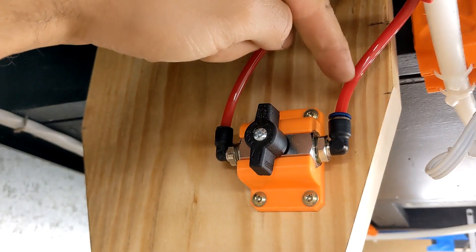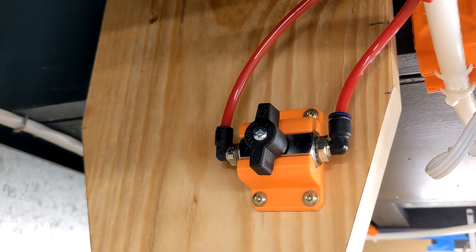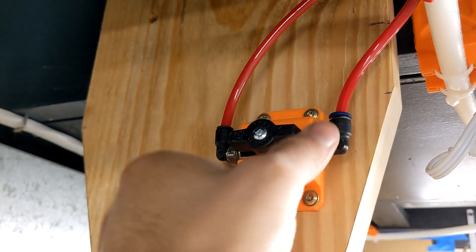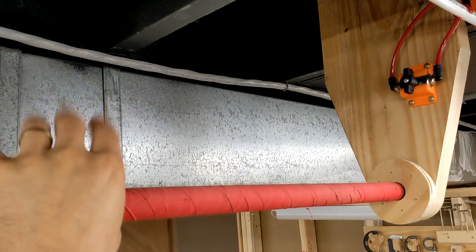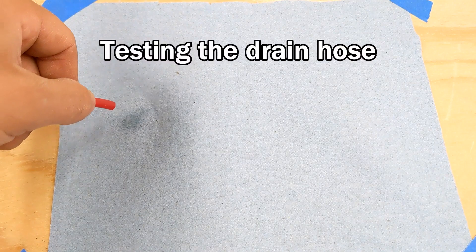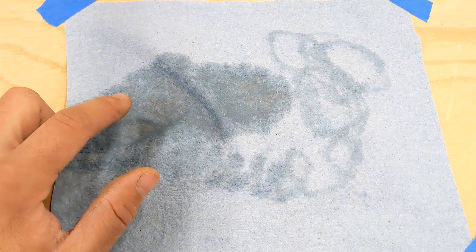That pipe from the drain is going into this valve, and the exit is going off to my sump pump — more accurately, it's going to spray into the sump pump basin. This valve is located in a convenient spot in my shop, making it way more likely that I'll develop the habit of coming over here and giving the compressor a quick drain, as opposed to walking over to the compressor frequently and draining it from the bottom.